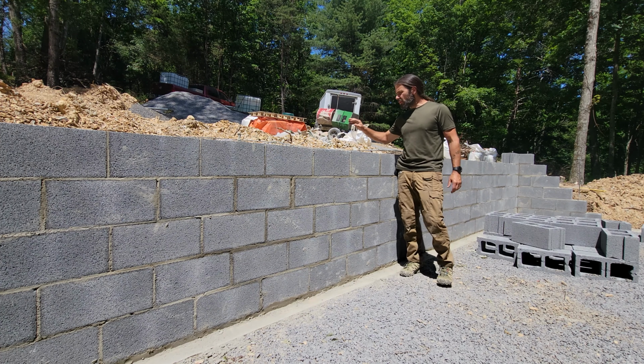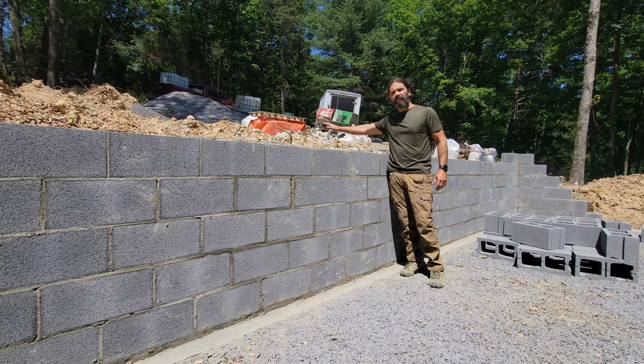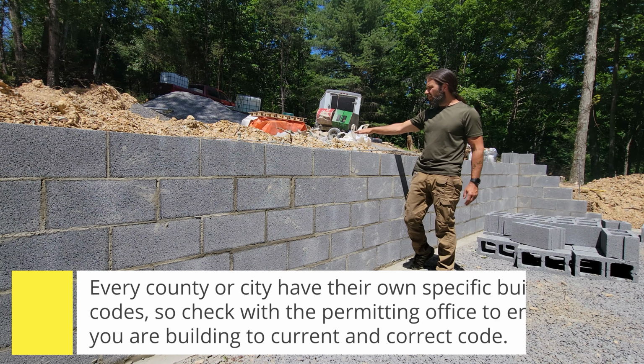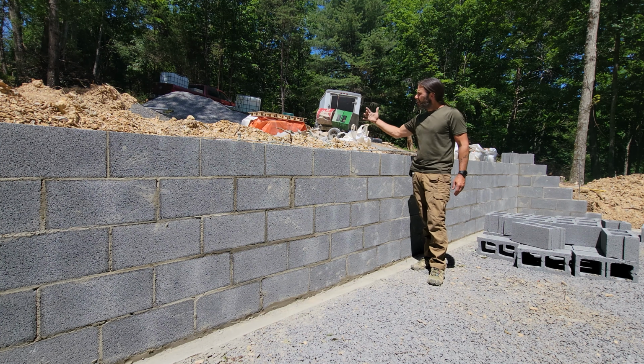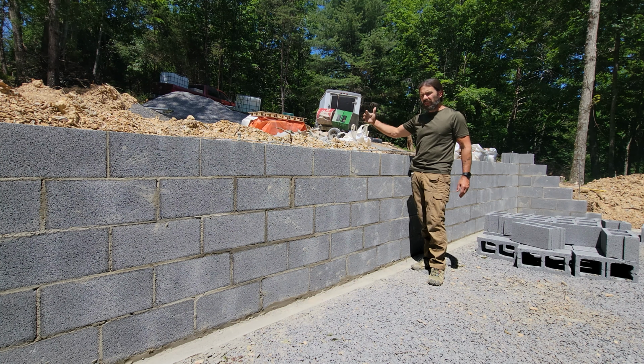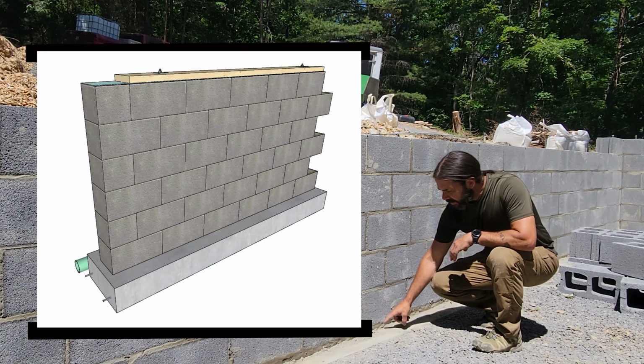The other potential requirement for vertical support would be if there's unbalanced fill, and that's if there's more than 48 inches. For an 8-inch block wall, I think it's 48 inches of fill on one side higher than the other. So that would cause this to act like more of a retaining wall. We're close to it. We should have about 40 inches on the outside, but I know that there might be a lot of pressure on this wall, being that it's downhill, a lot of potentially hydrostatic pressure building against this wall. When it is required, you have to put this rebar and tie it into the footer.